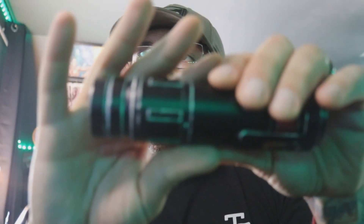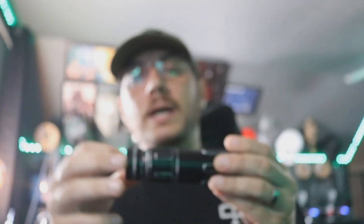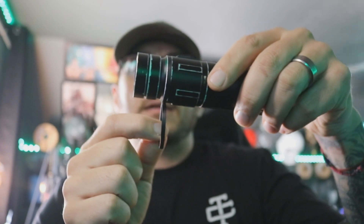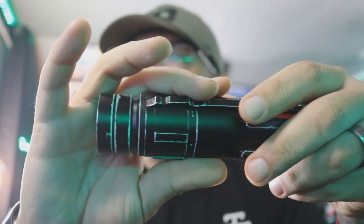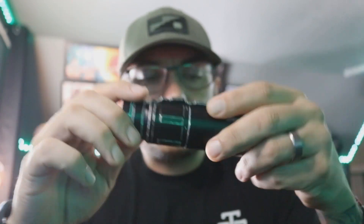So what I ended up doing — if you look at this handle right here — I put a 0.13-inch wide spacer right here because that was the amount of space I needed to back the back of the pummel off of the speaker so I didn't get sound distortion. I spent some time making sure I got the thickness right so that the claw right here still clocks correctly onto the saber. This is something that I will be doing if I do installs for anybody on this particular saber. I tried to make it so you would be hard pressed to even notice it if I didn't specifically point it out. It's right there where my pinky is — something similar was done to the Gen 1 when we put an 18650 in. It's just something I needed to do to get rid of the sound distortion.